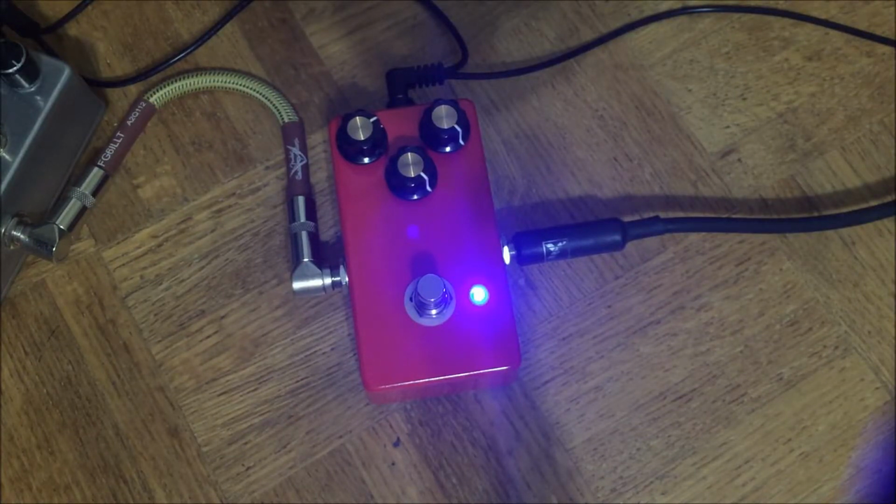The reason why I mention this is important, that it's just a passive treble cut style control, is that classic 3-knob tone benders, which this is not the same circuit as, it's based on the Mark II tone bender. I won't get into all that, they're just different circuits. But the 3-knob tone bender that did have a tone control, it was kind of like a Big Muff style control, a little bit different, but basically blending between a high passed sound and a low passed sound, which results in a very scooped sound. You can turn it to the left to get a darker, bassier tone, or to the right to get a thinner, trebleier tone, but that mid scoop is always there. This, on the other hand, just really affects the treble. It doesn't really do anything to the low end.